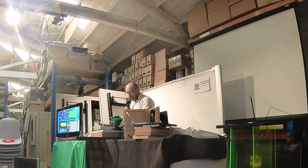2000, press go, that's just done it. If I go to the address 2000, there's the code in there, and if I press go, it runs it. So, you can do a smart copy. You can also do a block backup, so it doesn't actually update any of the code, it just moves it. So if you want to back it up to like an SD drive or any other location, you can move it from one location to the other.